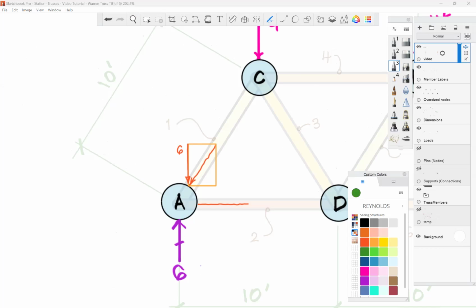And for these problems, you're going to either be given dimensions, lengths, measurements, or angles. So for this one, I think it's going to be easiest for us to use the 30-60 triangle sines and cosines that we've memorized, right? So all of our members are inclined with respect to the 30-60 triangle. So there's my 30, here is my 60. And we've already memorized that if the hypotenuse is 1, the short leg is 1/2, and the long leg is √3/2.